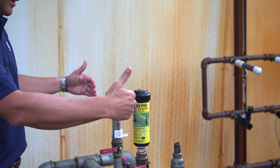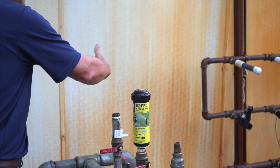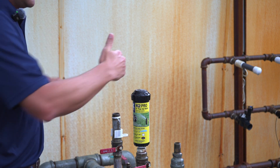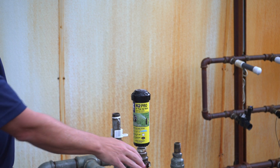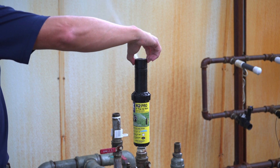In this imaginary installation, this is the driveway and this is grass. I want it to begin spraying here and go over there. So what I've done is set the left start over here and the right stop over there. As soon as I energize the system, the left start is where I want it to be.